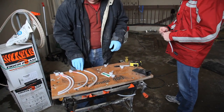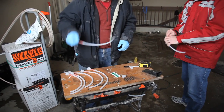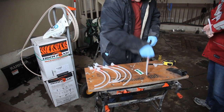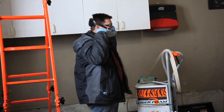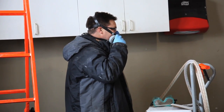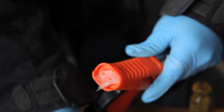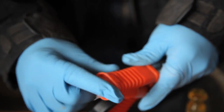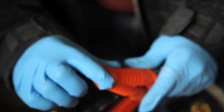This tubing is a friction fit over the ends of the spray nozzles, and these clip onto the spray guns, as you'll see in a minute. Before you start spraying, put on your respirator, test for a good seal, then don safety goggles. The last thing you do before spraying is apply petroleum jelly to the end of the spray gun where the nozzle clips on. This jelly stops foam from sticking to the gun when you change nozzles later.